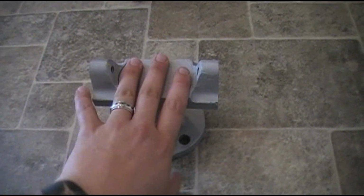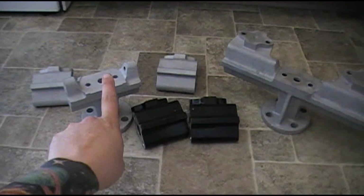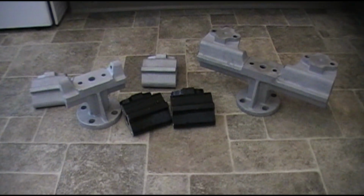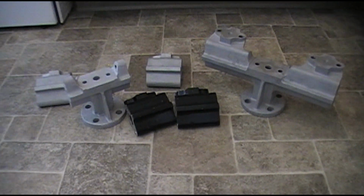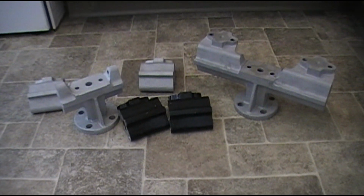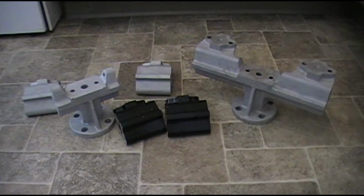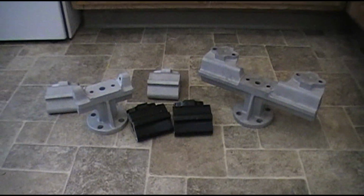So, the low-profile 5-chime manifolds were an offshoot of the low-profile 3-chime manifold. Now, in 1975, Dean Ellsworth was working with Amtrak and Nathan Erskine to develop a horn unique to Amtrak. The original idea was to use the P5A for Amtrak. Now, Amtrak, of course, later ended up going with the K5LA. That was another Dean Ellsworth creation, but the first one was the P5A. And Amtrak needed the low-profile 5-chime manifold for use, particularly in the eastern United States, where clearances were pretty low.